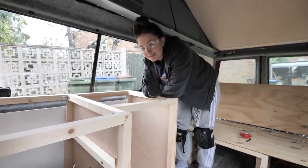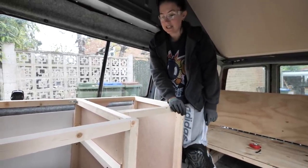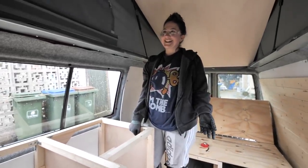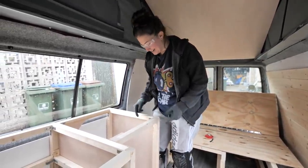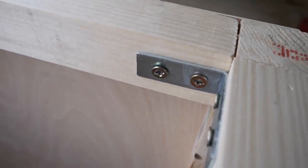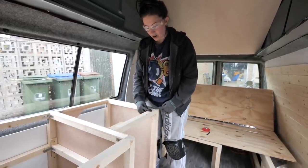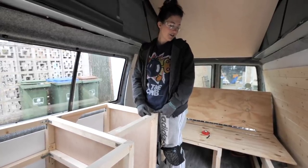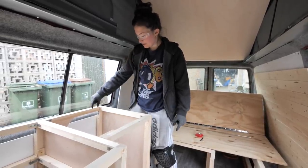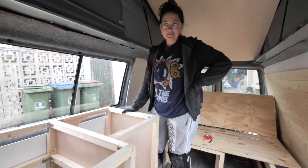I can only think of one solution which can be guaranteed without too much faff. It's annoying because the glue has set now, so I'm going to have to hack it apart a bit. I'm going to take all of these brackets off these pieces, then bring the jigsaw in and cut — it's 65mm over — so I'm just going to chop off 65mm from all four of these pieces, stick it back on, and then hopefully it will fit.